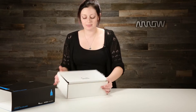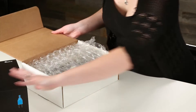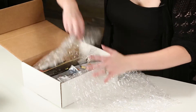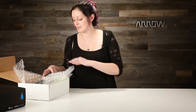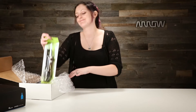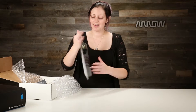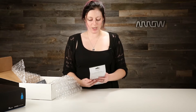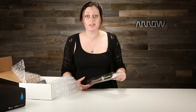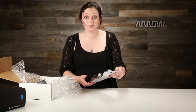There's a label on the top. So this is an introduction to soldering kit, and luckily it includes the things you actually need to learn how to solder — a soldering iron. This is an adjustable power soldering iron. It says it's adjustable between 16 and 30 watts, which gives you between 500 and 800 degrees Fahrenheit. So it's a pretty high powered iron.